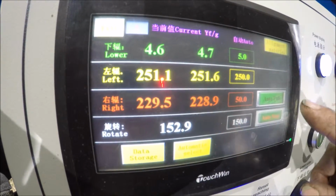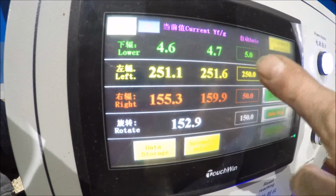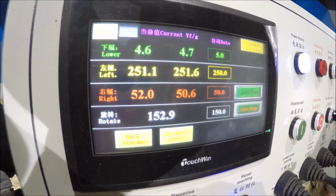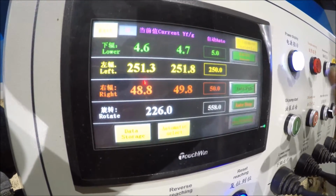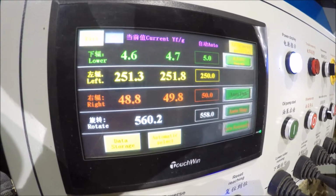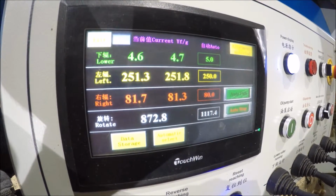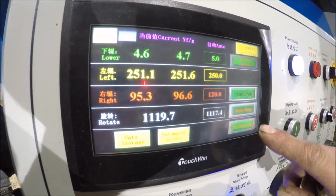But the part you got to do is stop the machine when the roller gets to 0, and the gap is opened up right afterwards for the starting spot. It can probably be reprogrammed so it'll always start in the starting position, so you don't have to pause it. At the end of the program it'll be at the right spot to begin with. But before this program, the rollers could be in some other position other than a starting position. And so I have it programmed that they go to a starting position first. This one here is flashing because it's showing it's clamped, and the auto is running. When it's flashing, it's operating.